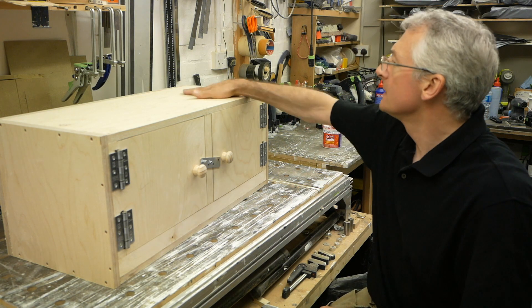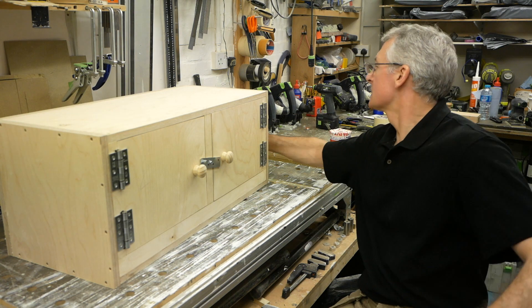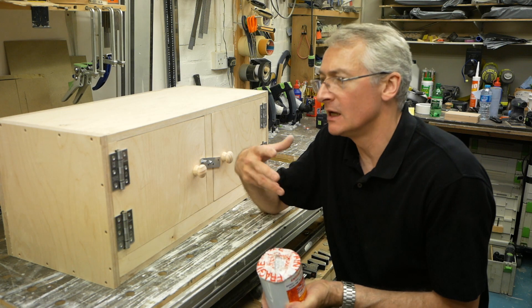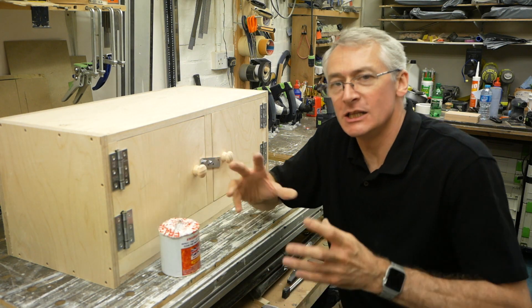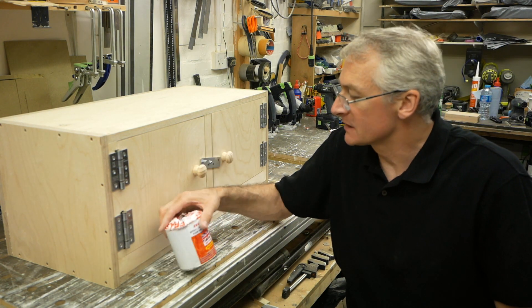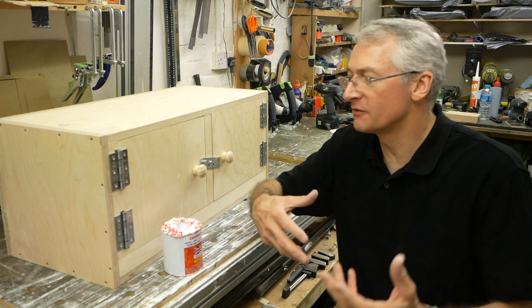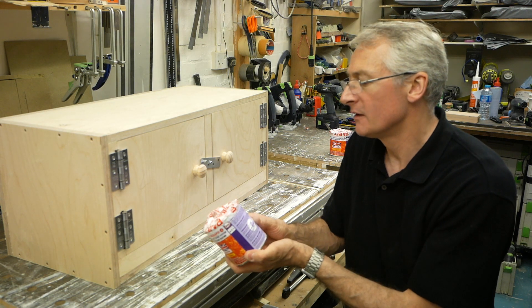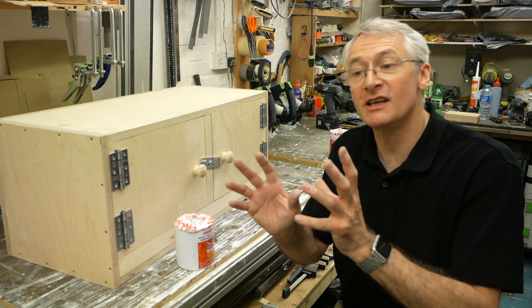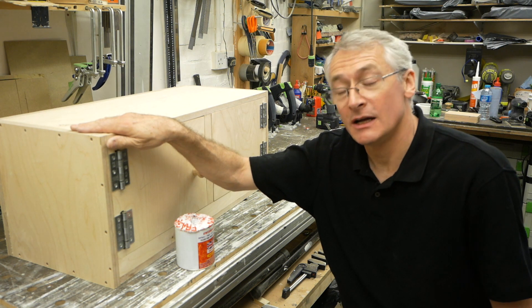There's a clear protective finish — this is part one, part two comes later. It's from Envirograph and it's a protective fire coating. It's not an intumescent paint — intumescent paints literally swell up to form a protective shell. This one reduces the spread of flame; it's class zero and class one fire retardation. If you wanted full UK FD30 — 30-minute fire protection — you'd use an intumescent paint.